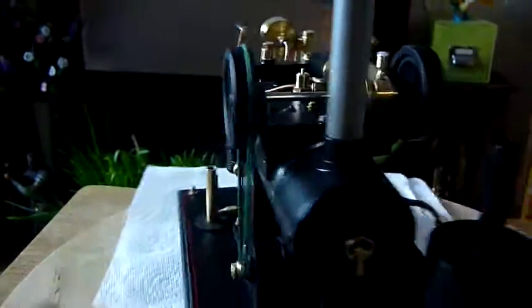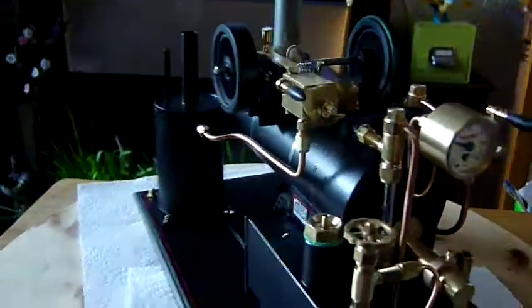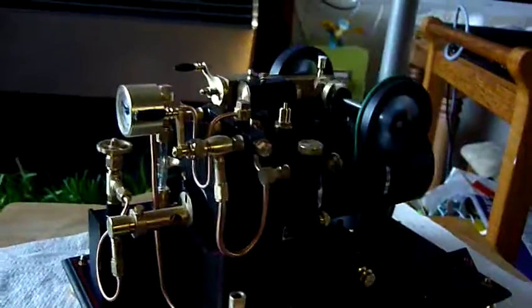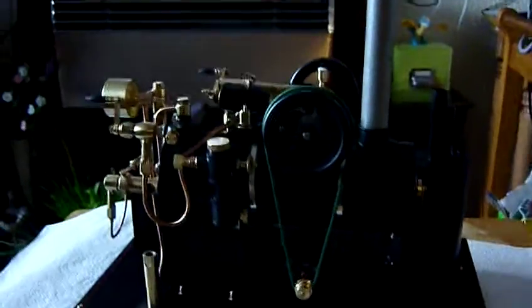I suppose that's why they put it there — better into a container than in your face. Very, very nice engine. I haven't timed it but I'll do that next steaming — probably getting about 20 minutes out of it. I only have them very low, because if you turn Regners up it's the whistle. As Paulie says, they'll scream like a banshee when you run them too high. It is basically the same layout as a Regner Vincent, which is the one with the chain drive. Where the chains are, they stretch, but still very good engines.